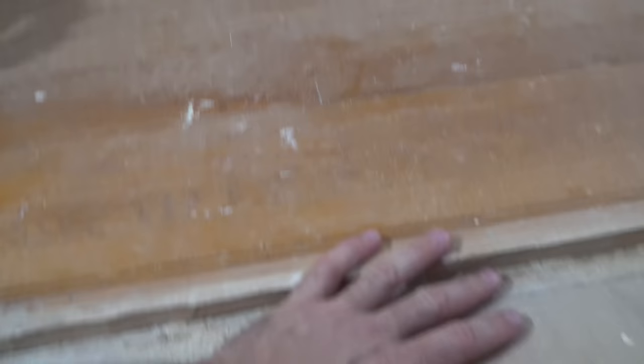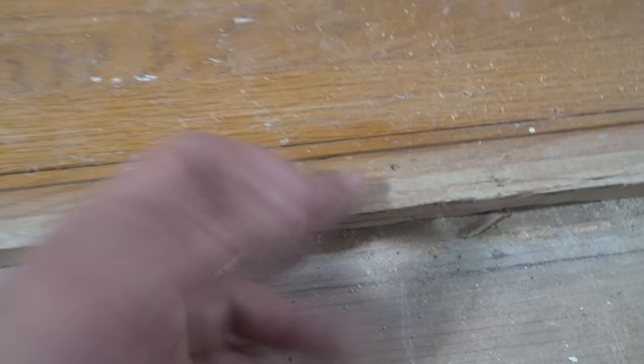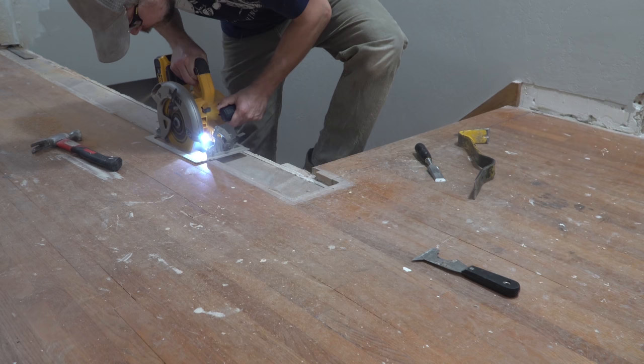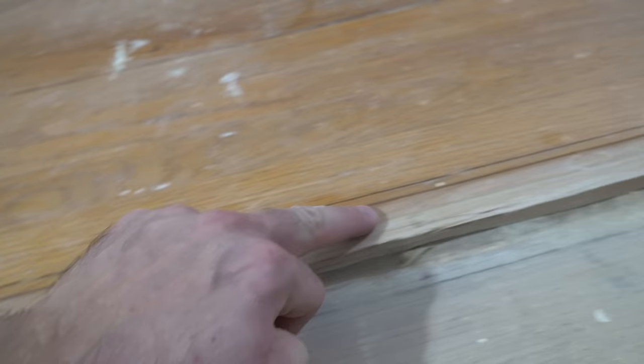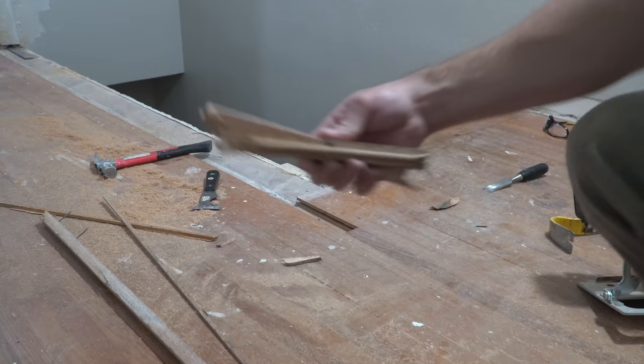If we come over here to this first board, which you can see is all kinds of rough sawn — especially right there, they just sort of hacked it so it would fit in alongside the wall that we took out. If we look really close at this very edge, they actually just nailed right straight through the top — there's a nail, there's a nail. So how do I pop this out without ruining the tongue on the other side? I took the circular saw and cut a groove in here along that edge on the other side of those nails that I can see.